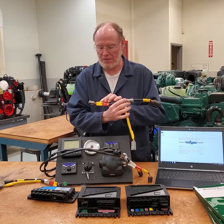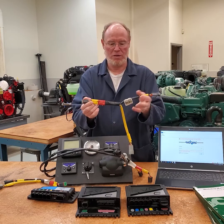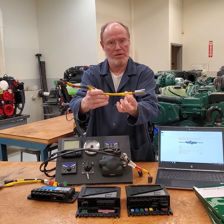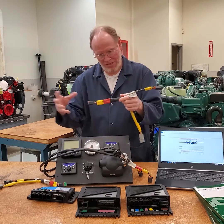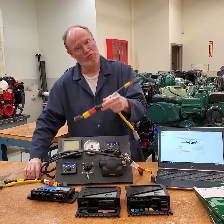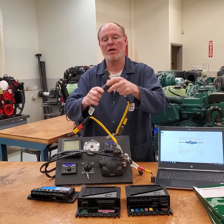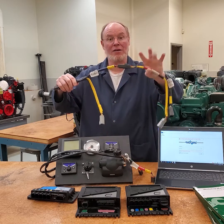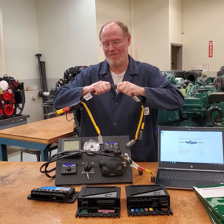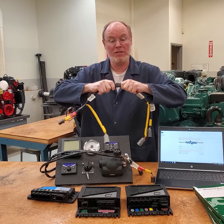If I look at this harness, it says multi-link, and the other end says multi-link. This connector's dark gray and this one's dark gray — male, female. But there's also a yellow harness that drops out called the multi-link breakout. The rule of thumb is: any time you want to tie into the multi-link system, plug this into the node and continue to the next multi-link. It's always multi-link to multi-link — just follow the color code. You have to plug a multi-link into a multi-link. Here's another thing that could be a mistake: you plug it in and think it's done. Did you hear a click? You have to hear a click. You have to physically click it.